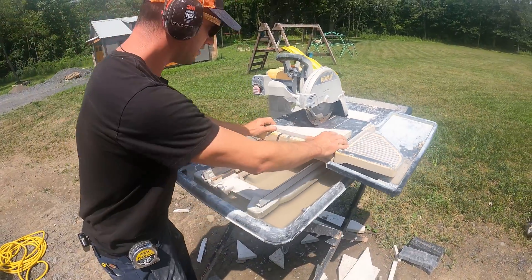You can even change the angle of the guard. If you want to cut straight down like this, or depending on what angle you want the saw to be at, you can set the guard to help you out. Those are the three different ways that we cut the pavers. Our go-to is this wet saw — it's expensive, but it's worth it for your safety. You can rent these things or get cheap saws, but a lot of times with the cheap saws you won't get the accurate cuts that you will on this DeWalt that has a sliding table.